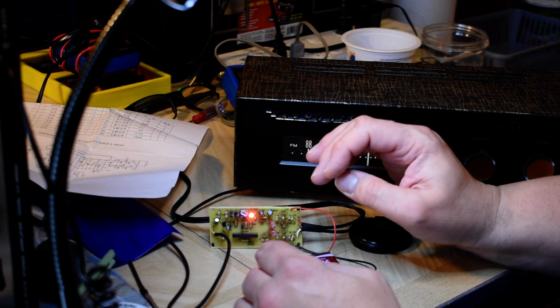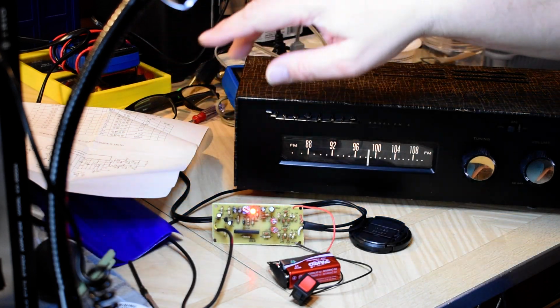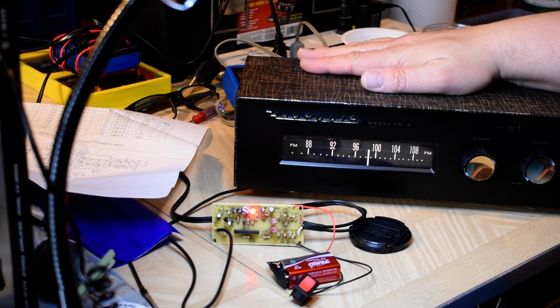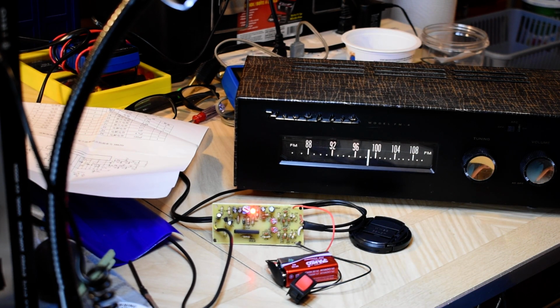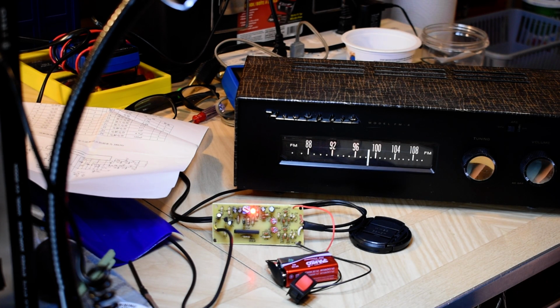What I've basically done is I've taken a stereo set of patch cords, soldered them on here, and they're into my little Kenwood KA2000A, and then taken a single patch cord and put it into the multiplex out on this, hooked up a 9-volt battery and a switch and turned it on. Without even setting anything, there's one adjustment here that sets the VCO, or the speed of the multiplexer, and I was getting stuff in stereo right away.